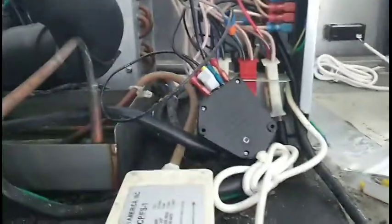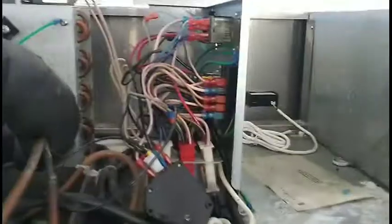And I had to mod out the signal to the pressure switches, and it goes here to this little relay contactor. So I'm going to put a thermostat in series with it. From the thermostat, I'll go to the contactor, so I can go on and off by temperature. So that's what we have for now. I'll explain it a little bit later, and let's get to the job.